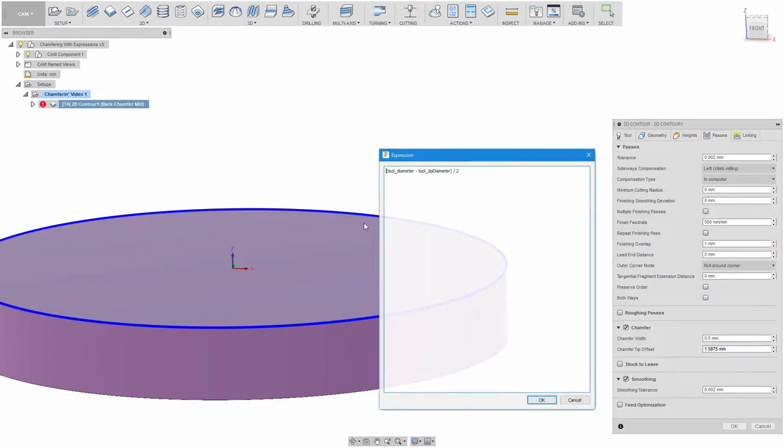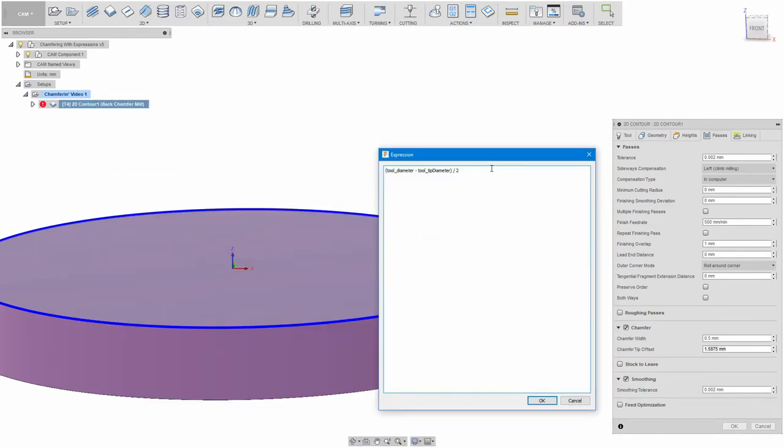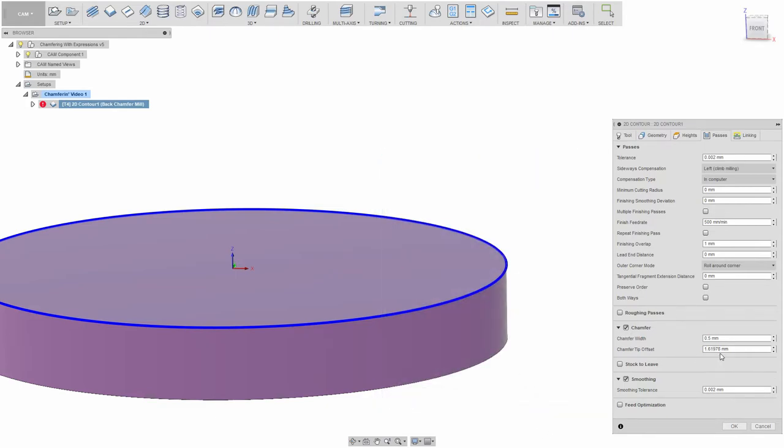Since expressions appear to be JavaScript, I look up math functions in JavaScript when I need them. The JavaScript function for tangent is math.tan(), and you enter the value you're trying to get the tangent of. So if I type math.tan(45) and hit OK, it gives me a value — but it's 1.61-something, not 1. The calculator says tangent of 45 is 1, so something is wrong.